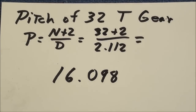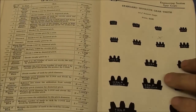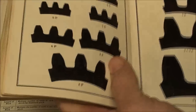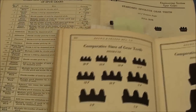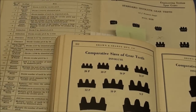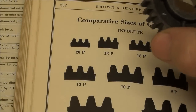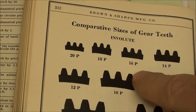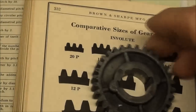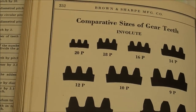Here are two alternate ways of finding the diametral pitch. You'll find silhouettes for involute gear teeth in most gear books. Taking the gear and just matching it up until you find the right one — we can see that it fits the 16 pitch. It's not going to show up well on video, but it does match. Use the mathematical method though — it's far better. There are also gear tooth gauges used to determine pitch, as well as another type set up like a thread pitch gauge.